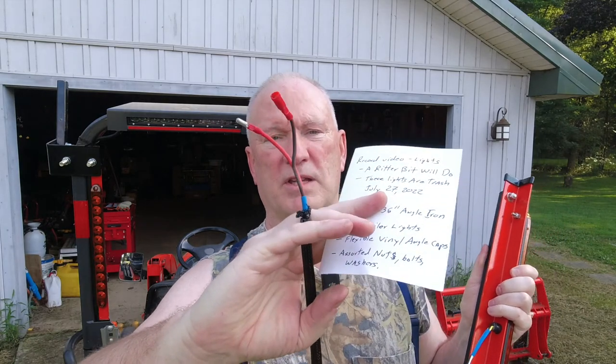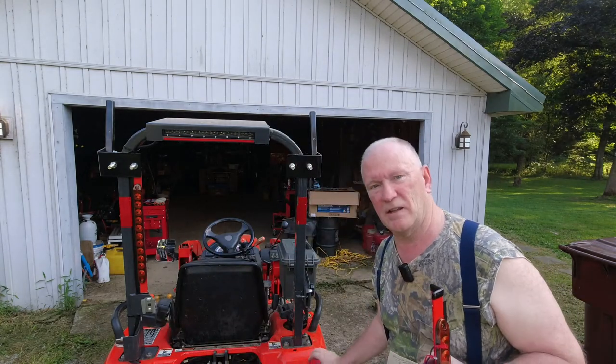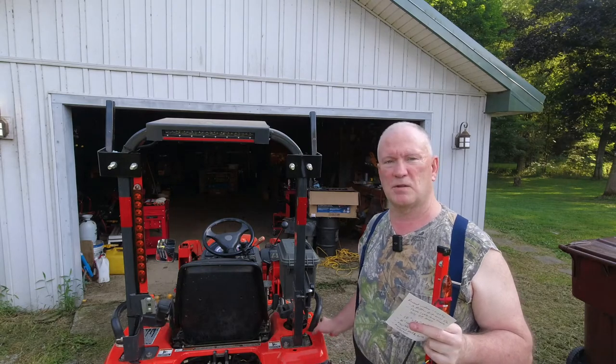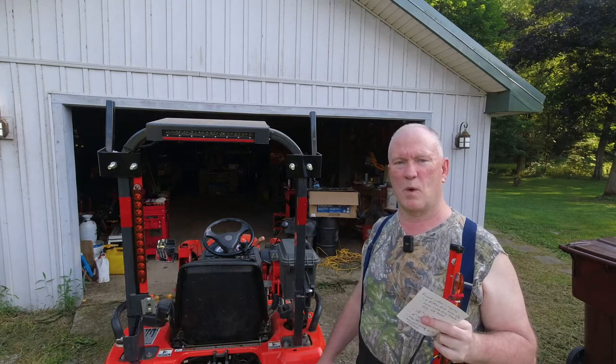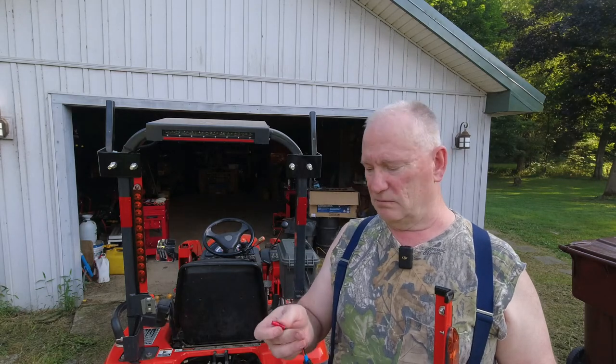I used some epoxy to epoxy these end caps on. For wiring, you're going to need some wire — I used 16-gauge, but I'd recommend 18-gauge. I used bullet connectors; the reason I use these is behind the tail light is where, if you have turning signals already on your tractor, just follow the wires down and you'll find the connectors. I found the connectors because there was nothing connected to them, so it's connected right into the wiring system. I never recommend cutting into a wiring system — always try to use available connections. It makes it cleaner and your wiring harness will last longer.